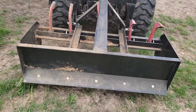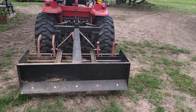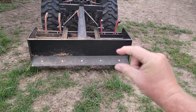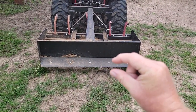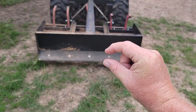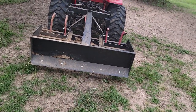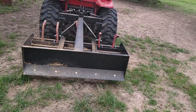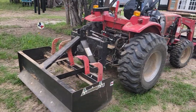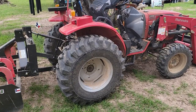It's hard work. The road ended up with a good crest on it. Then I floated the box blade about an eighth of an inch above all that I had ripped, and went back through just dragging it to the middle. The road looks good. What I don't know about the road is how much clay there is — we'll go up and take a look at some of the odds and ends.